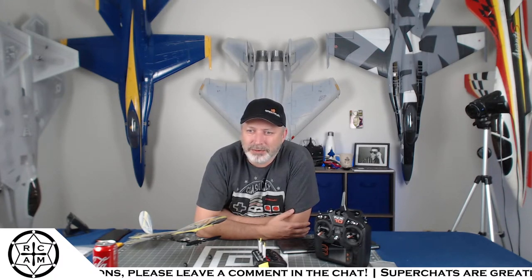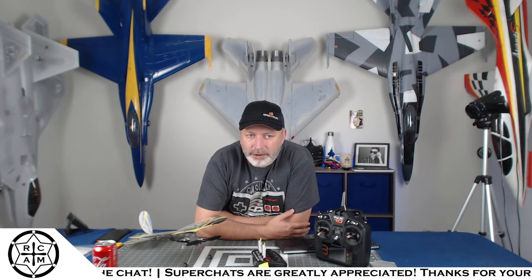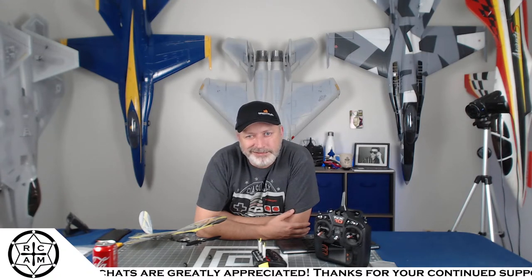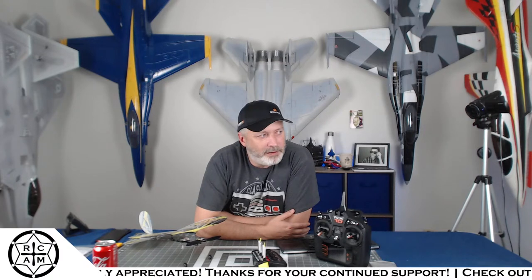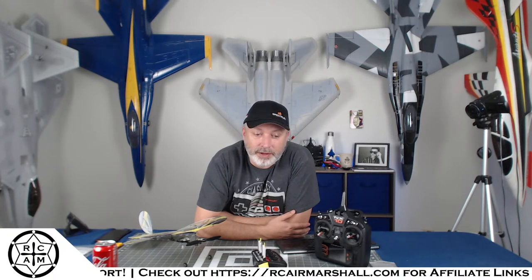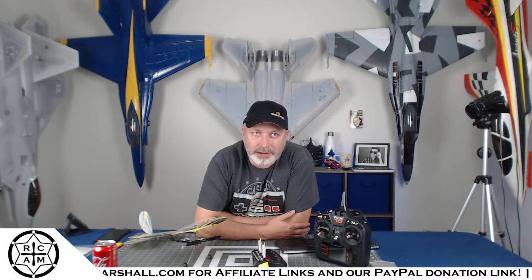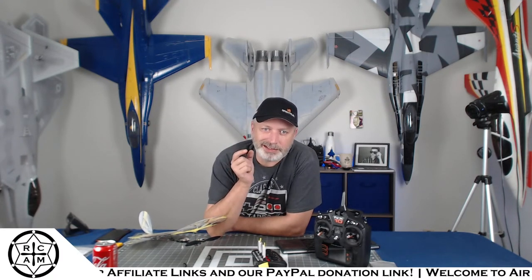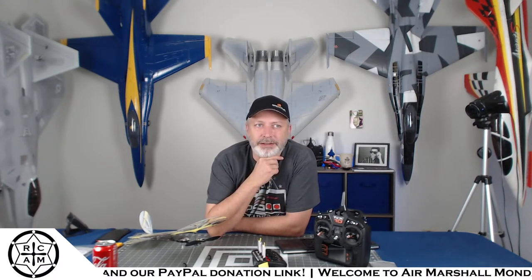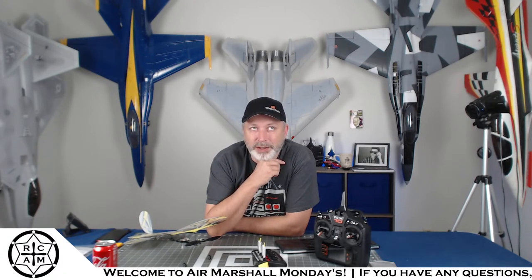Do you need a monitor and a keyboard to set up a Raspberry Pi and OctoPrint for a 3D printer? It depends on how cool you are. You could technically do it, because all the initial setup is done using an SD flash utility on your PC. You would flash the SD card, and the first time you put it in your Raspberry Pi, it's going to expand it and just make it work.